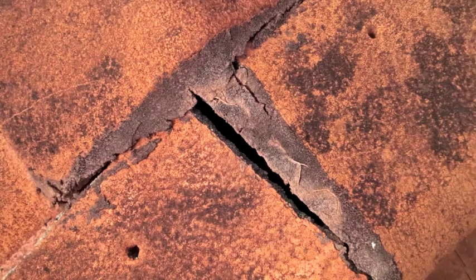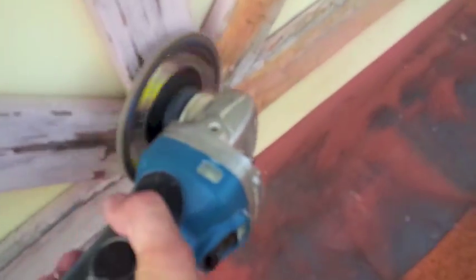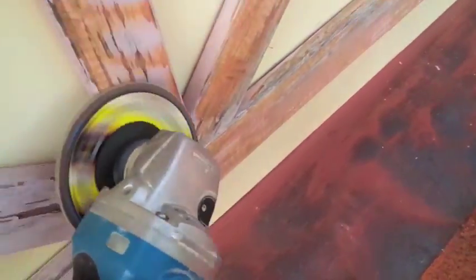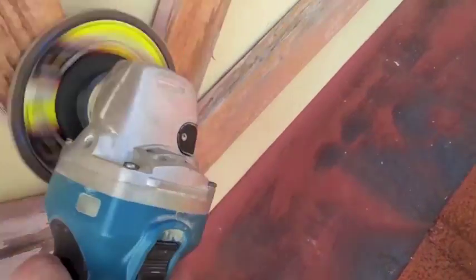I'm going to go around the whole roof and check it all and silicon up those gaps. These cracks are going to cause problems — particularly where this one is, it's probably going to cause a problem with your eaves. The water can run down inside the roof and create problems with your eaves, maybe stains, and you might have to replace or repaint them. If the cracks are more central on the roof they could let enough water in to cause a ceiling cave-in on the inside, which I fix a lot. You'll see a coffee-colored stain appear on your ceiling, then it'll start to bow.